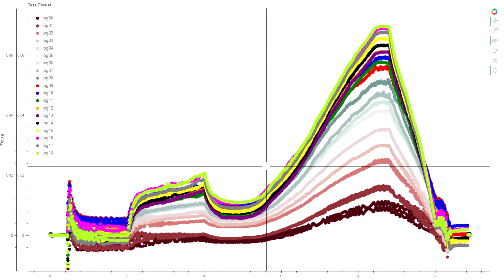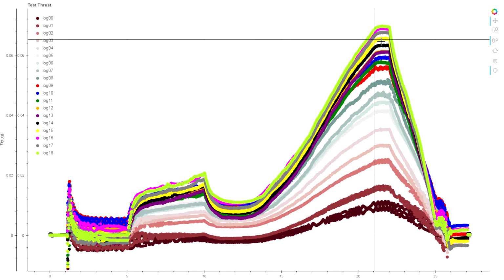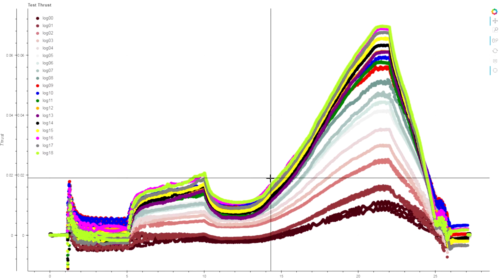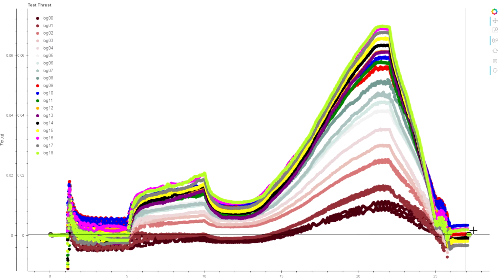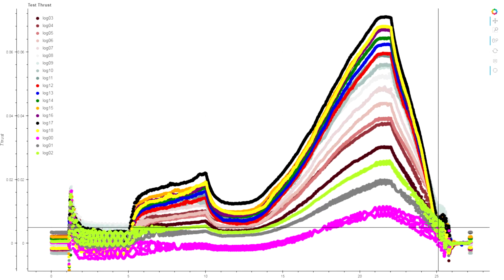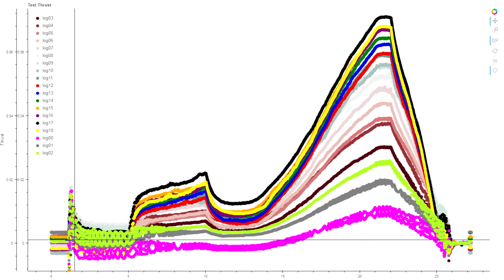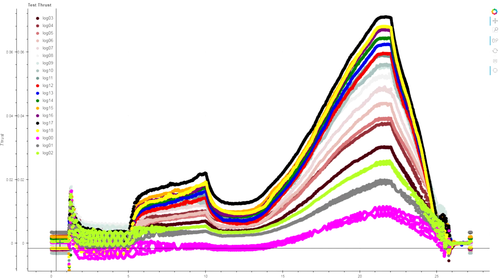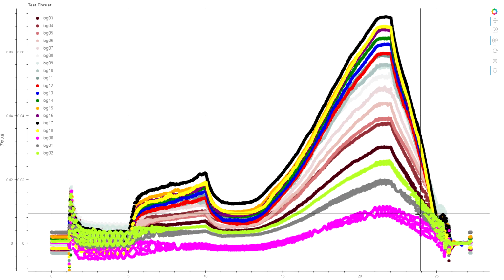So the most obvious thing to do here is, let's say the data we're most interested in is closer to the end of the test. So let's just zero out all of our load cell values at the end instead of at the beginning. And then we get a chart that looks like this. We're still able to zero everything out easily. You get the inverse at the head where all of these are offset. But the spacing here hasn't actually improved any.